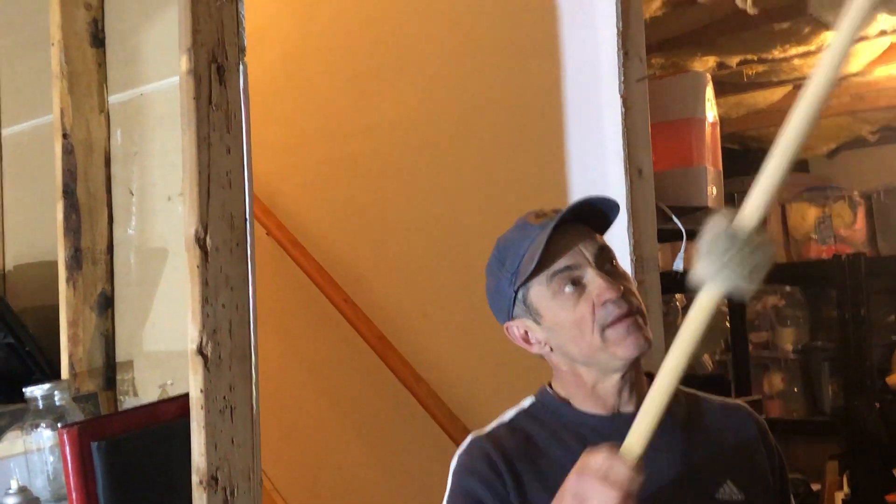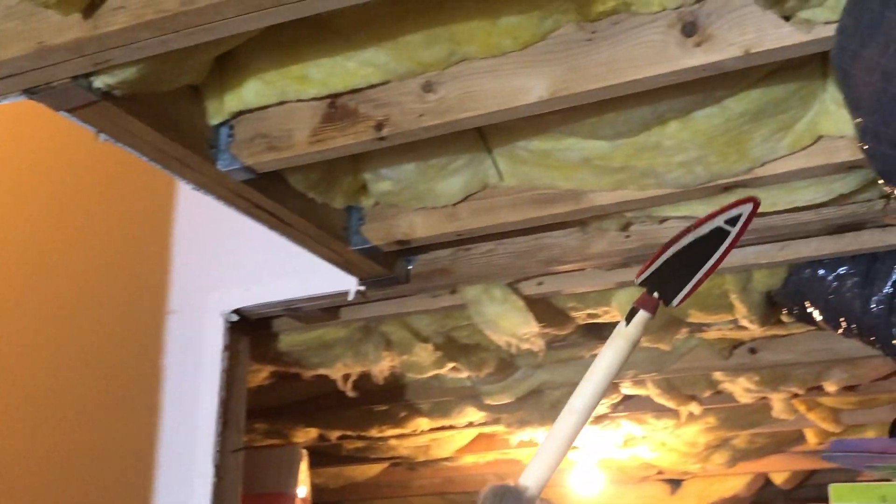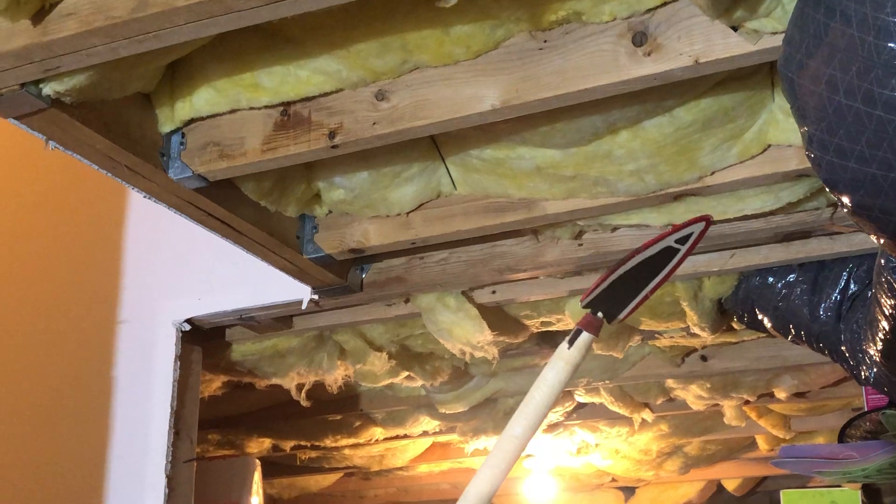One of the main reasons is my house is built a little bit different than the house that Mr. Burley has been building. That house is framed with TJIs — they are built out of basically little I-beams that are manufactured out of wood, which we talked about. My floor joist system is built like the diagram that I often go over in class when we're talking about floor framing terms.